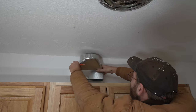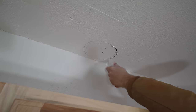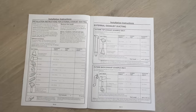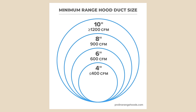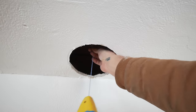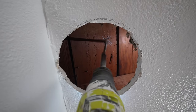I trace the outline of the ducting piece and use a drywall handsaw to cut the hole for it to feed through. A common question is what size vent or ducting do you need — my directions said to use 6-inch ducting, so I figured 7-inch would work. There's a chart based on the CFM of your unit for what size ducting to use. My roof is very close, so I use a long spade bit to give me a pilot hole visible from the roof. I used a chalk line like a plumb bob, lining the string up with the center point of the hole and marking it on the roof. A spade bit with a long extension got through the roof, and now we know that pilot hole is the center of the cutout for our vent.